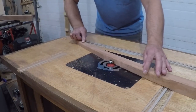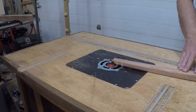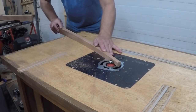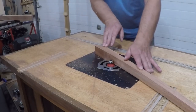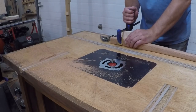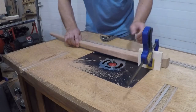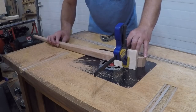Before it is all said and done I'm going to do a ton of shaping by hand on the legs, but to save me a bunch of time I removed the sharp edge with a round over bit at the router table. The legs are going to have a little cloud lift detail on the back edge as they meet the bottom of the apron. To be sure they stop all at the exact same spot I clamped a spacer to the end and routed along the edge until the bearing hit the spacer.